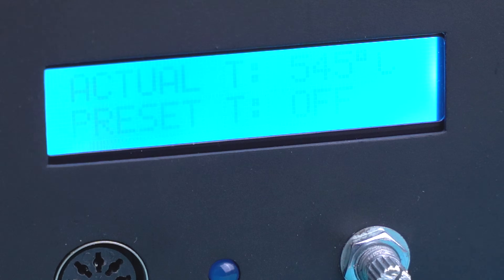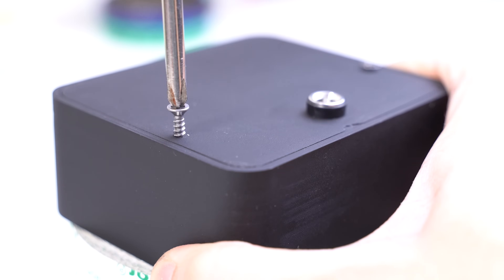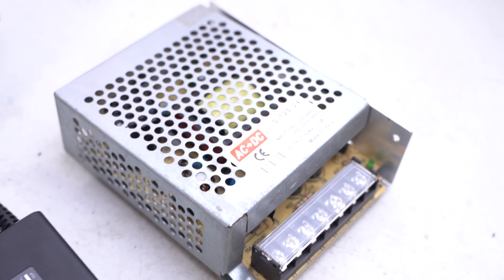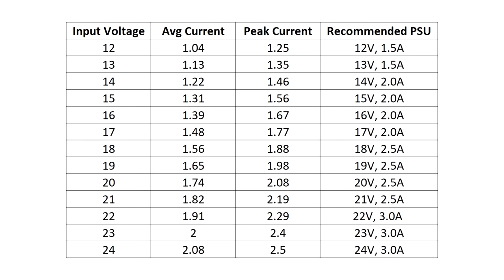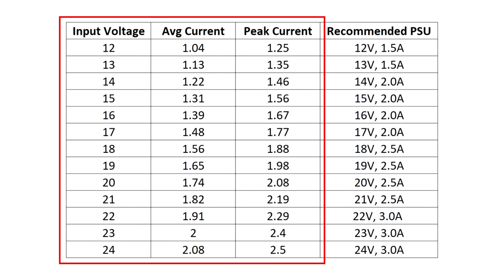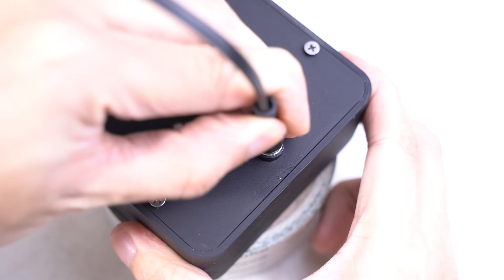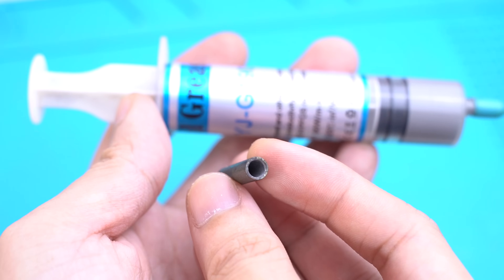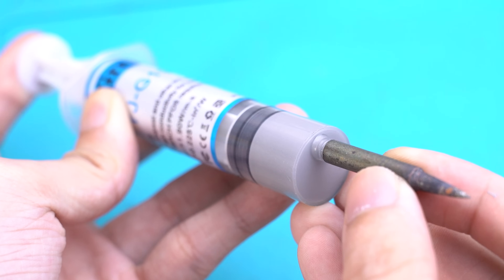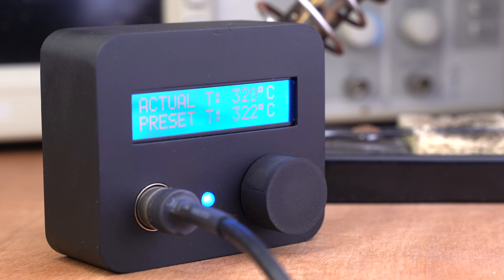The finishing touches: if your LCD is not working, you probably have to adjust the contrast knob. Once your project is well calibrated, you can screw it together. The project works at a maximum voltage of 24V DC, meaning you can power it with batteries or a power supply. Repurposed laptop chargers would also work. I did a test by supplying it with different input voltages and recorded the corresponding current draw, arriving at my power supply recommendation: 24V 3A gives you the best performance. As a bonus soldering hack, adding thermal paste inside the soldering tip significantly increases the thermal performance, giving you faster warmup times. And that's how you make a cheap Hakko 907 Variable Digital Soldering Station. I hope you like this project — thanks for watching.